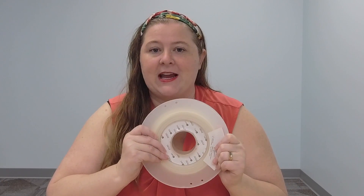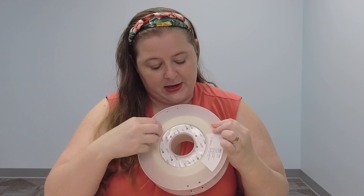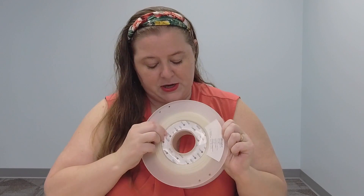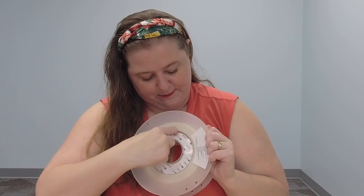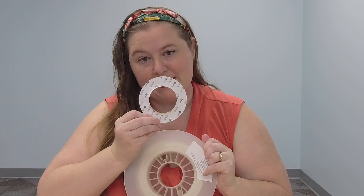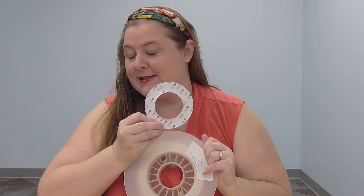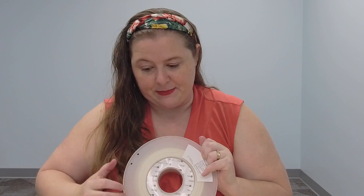The first thing you want to check is that your filament is in fact NFC-enabled Ultimaker filament. In addition to it needing to be Ultimaker filament, you also want to make sure that you actually have the NFC antenna in place. If this cardboard ring is missing, it's not going to have anything to read because this is your NFC antenna. Slide that right back into place.